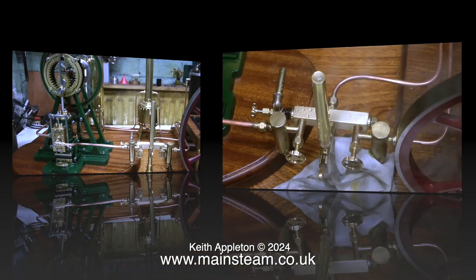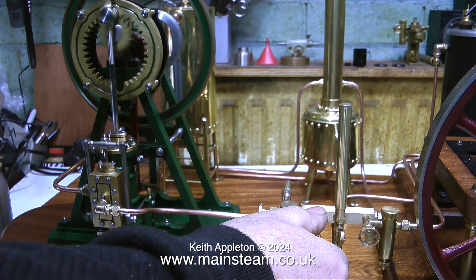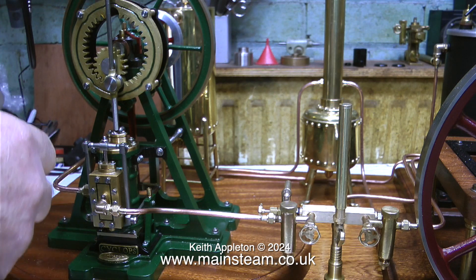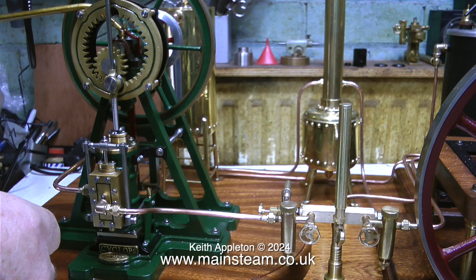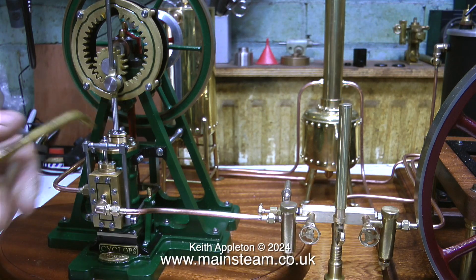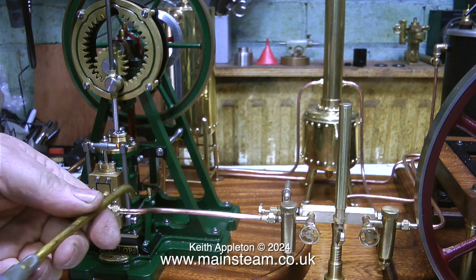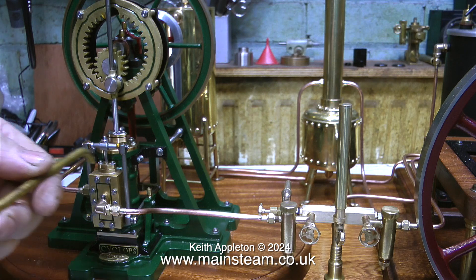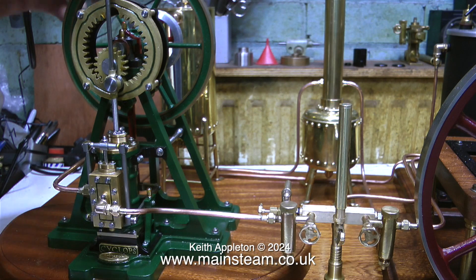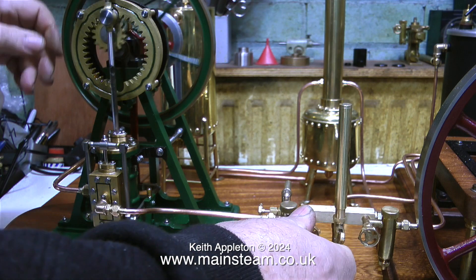These steam engines are not fitted with drain cocks, so I'm very carefully opening the valve to see what happens. Sometimes you get a hydraulic lock at each end of the cylinder, but this is not happening on the Cyclops engine. Before running the engine continuously, I make sure there's plenty of oil on all the oiling points — wherever anything is moving, it needs some oil. In one clip the piston is at the bottom of the stroke so it won't start; I left the steam valve open so some steam gets through to keep it warm. As the steam pressure increases, I turn it off — and interestingly, as I open the steam valve the safety valve blows off. Purely coincidental.